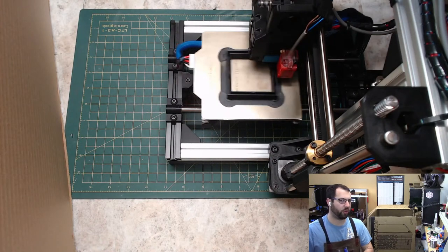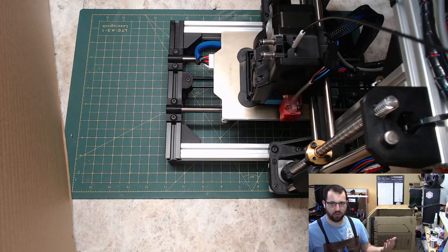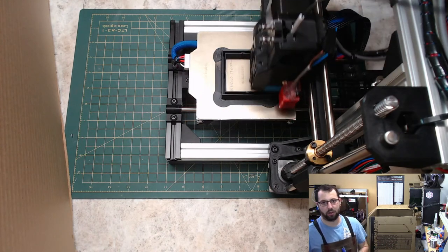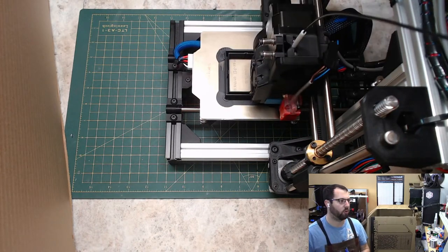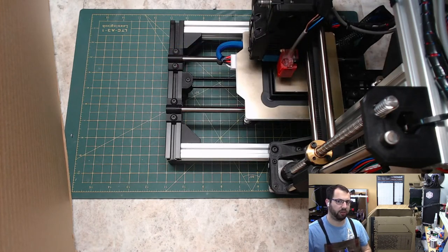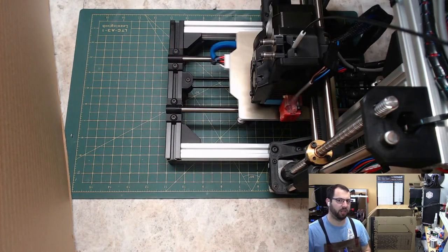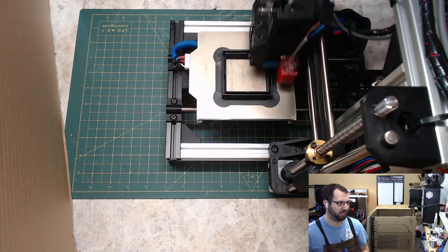Basically, I was able to get crisper corners with traditional bearings than with IGUS bearings. Everything was still fully functional, and in cosmetic prints you're never going to notice it. But if you print a cube side by side, I did get slightly crisper corners. Air bearings on a printer? These are cheap do-it-yourself 3D printers, CNC machines. Certain things that work really well in industrial CNC just do not scale down to our size and price point, unfortunately.